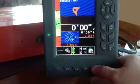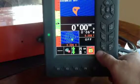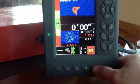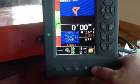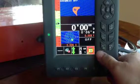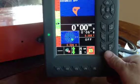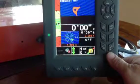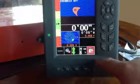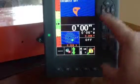Laser modes, you've got your laser that's off. Then the second mode is just standard laser, so you measure sea level for like plans, hit a benchmark, put in the grade, all your marks, all your grades will be there. Next one is A, where you're measuring absolutely off the laser, so you've got a basement grade, a tile grade, whatever your grade is, you put it to it, you stay in that grade.